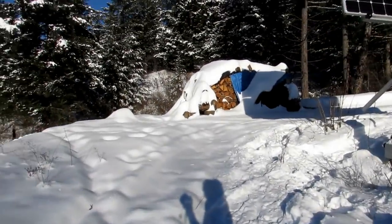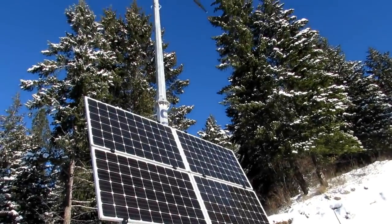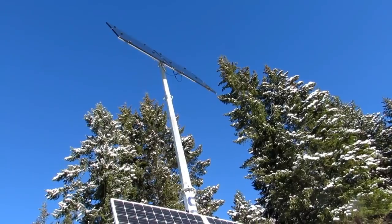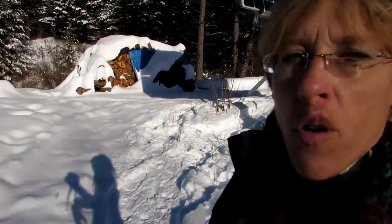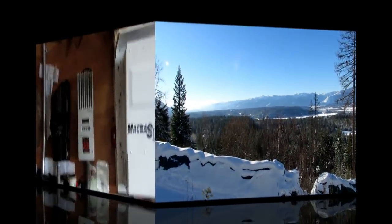Sometimes you just have to adapt. This is not the best setup, but we're not made out of money. We can't afford a tracker, and we couldn't afford to revamp this, so we're stuck with the pole. When you learn to adapt, you'll go a long ways and save money. Here's a little tip on wind turbines: if you're thinking about one, you have to have a certain amount of wind that is sustainable and gets up to a certain speed before it will even generate electricity. If you live in the Dakotas or way up high in the mountains where there is sustainable wind, it might work. But if you have sporadic wind, it's probably not the way to go. Buy more panels — they're cheap.